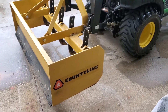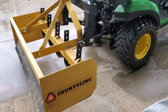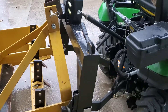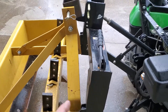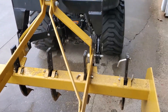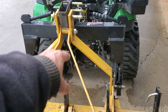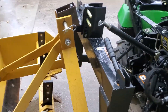We're looking at a County Line box blade from Tractor Supply that came with this John Deere 1025R tractor. When I added the Quick Attach, like other people have found out, the way this County Line box blade is set up — the linkage in here — it doesn't work with this tractor with a Quick Attach. Other people have used Quick Links or other devices or fabricated something.